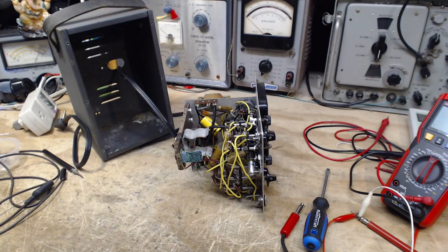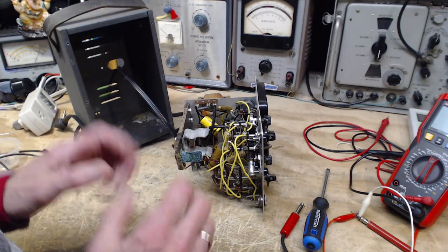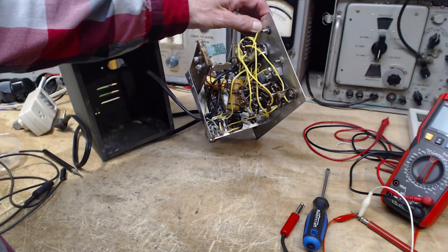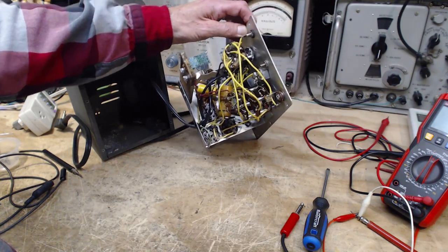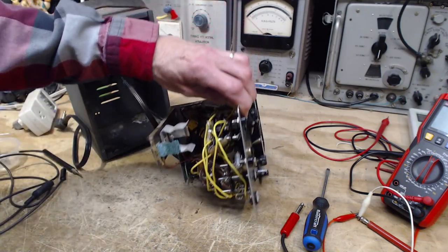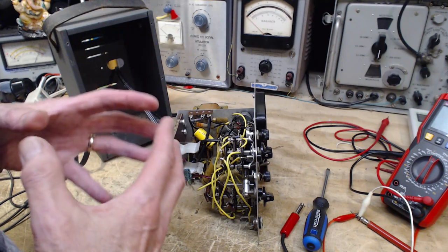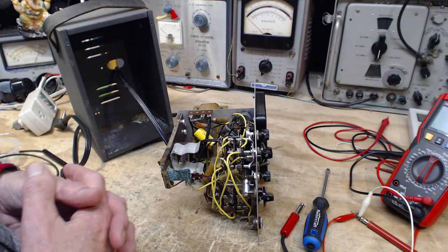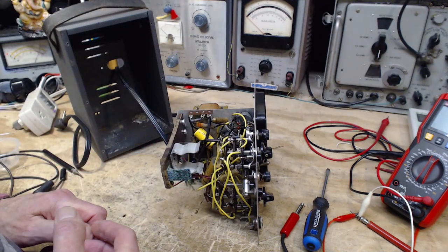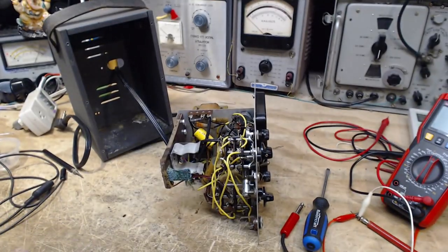We have lots of aluminum available, so the thinking was: aluminum wiring in your home. I don't know if I would even buy a home with aluminum wiring - it's all the connections and all the boxes. People with aluminum wiring who want to change an outlet or switch may innocently buy a regular wall switch that's intended for copper. You need to buy special ones intended for aluminum, otherwise you are really asking for trouble. I think periodically you should be tightening the screws on aluminum wiring connections.